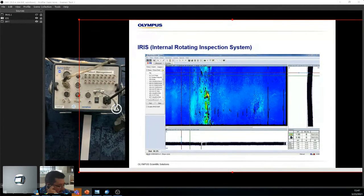And then for ECT, ECT is actually pretty decent as long as it's non-ferromagnetic. As long as you have a good calibration sample, everything goes well. I'm trying to think of a major disadvantage about ECT. I'm almost preaching to the choir here, but I'll think about that one a bit more. I'll start with the easy ones. Oh, and also for Iris, it's the scan speed, very slow. Because it's a slow scan speed, it takes a long time, right?